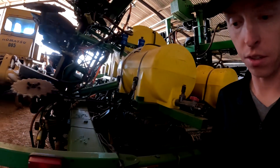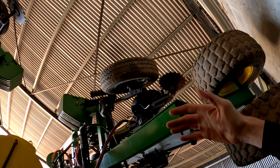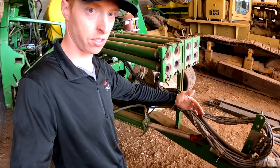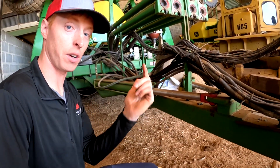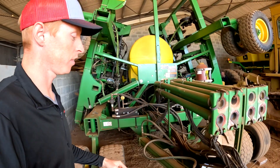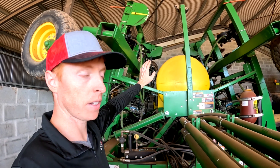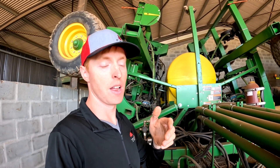Here's a trailing wheel to help indicate where they're at on the side hill if the machine is drifting — you'll notice an indicator up there. What that does is indicate how much this hydraulically driven hitch is offset from side to side. They need this because of the many hills and mountains here — they can't always go up and over them straight on, so they've got to be able to steer the machine with the hitch. That trailing wheel has sensors on it and an indicator in the cab to tell them where the machine is — if it's off one way or the other, lights or alarms come on so they can steer to adjust.